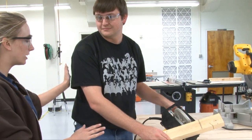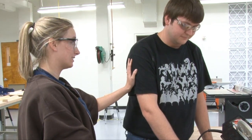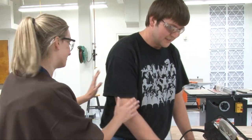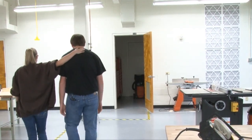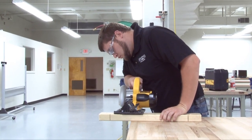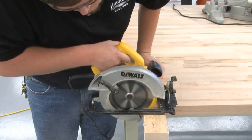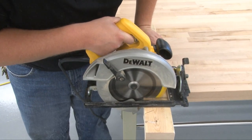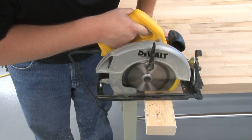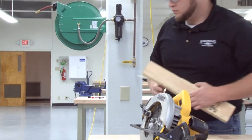Before you do anything, do you even know what you're doing? Sawing. Teacher again. If the saw starts to bind, do not force it through — let go of the trigger and the saw will stop turning, then remove the saw from the material. Be mindful of what material is near your cutting station; if there are objects that could get in the way, move them before you start to cut. Always cut on a solid surface — never cut with the material only laying on the ground or across your lap.